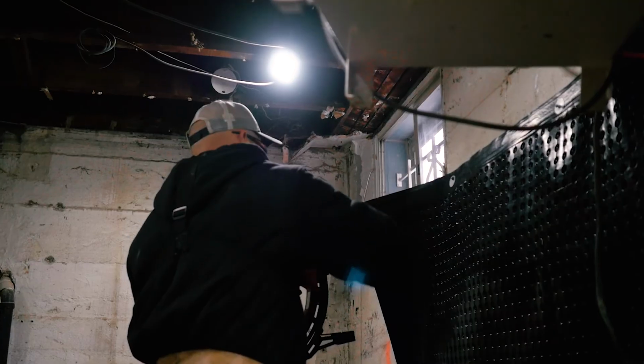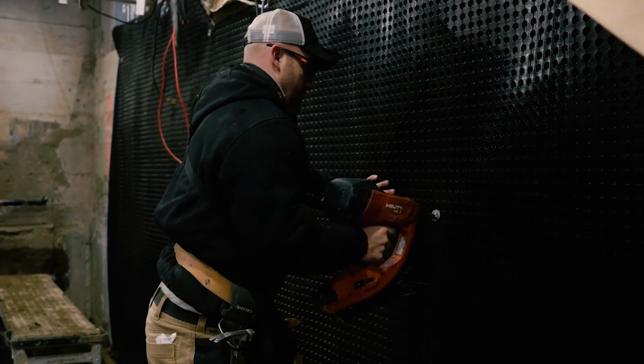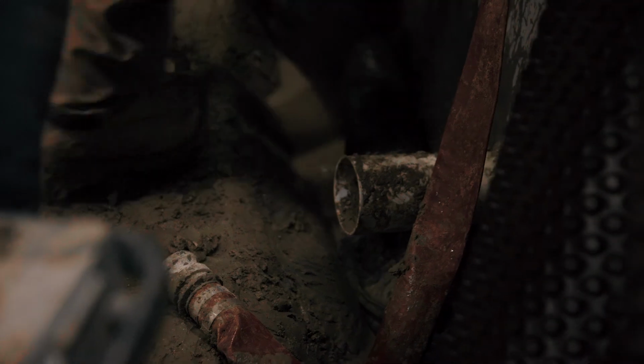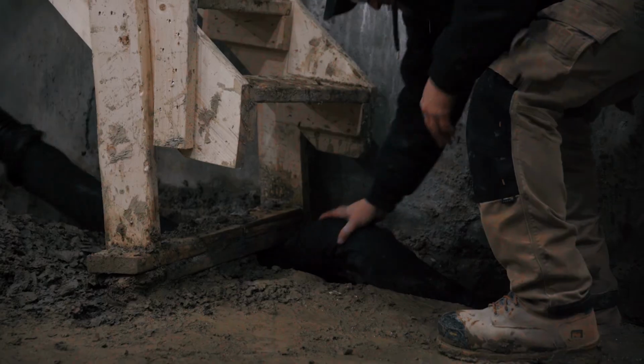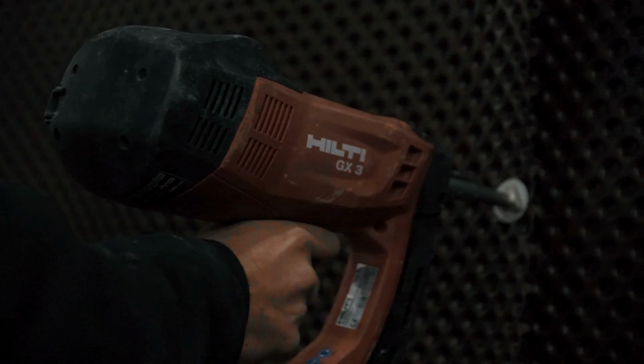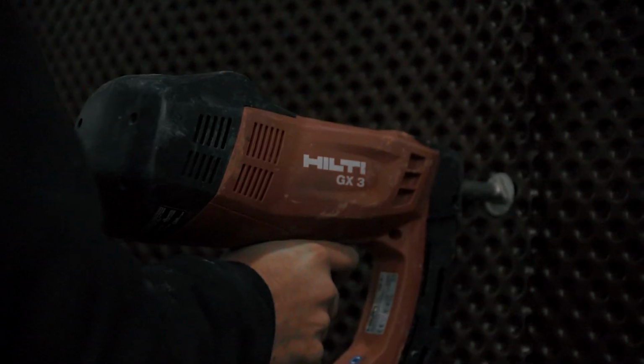All right, since we're done the underpin part, we have to do the interior waterproofing part. So the first step is we install the drainage board. That helps with any water that penetrates through the foundation. It travels down the dimple board into our weeping tile system, which is connected to our sump pit, and then our sump pump will eject all the water to the exterior.